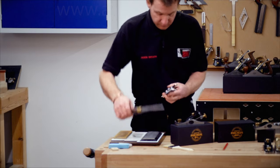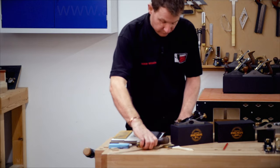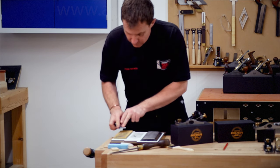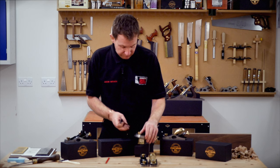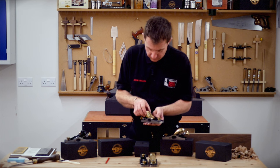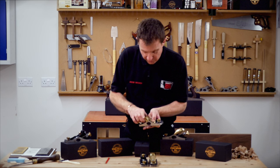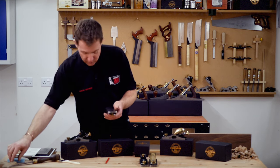We do the back. Then undo it with a screwdriver. A little bit of polish and compound on the leather strop. Drag that along, move sides — that'll get rid of the wire edge. That feels pretty good. So we can put it back in, get it located. We'll do the lock up — turn the brass wheel inside here. It's a little bit fiddly, but winding that up, locking it in place. Feels good.